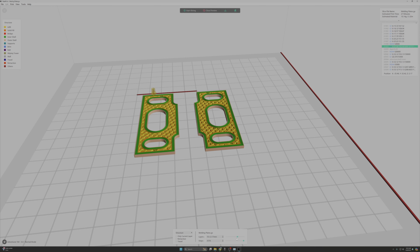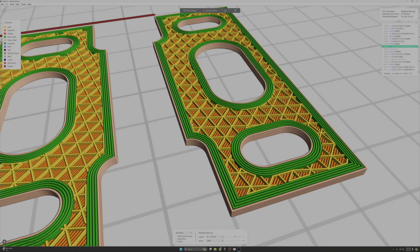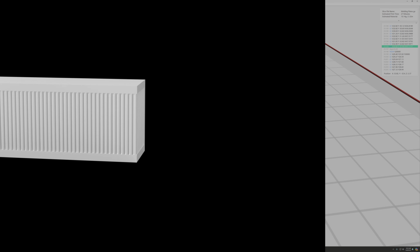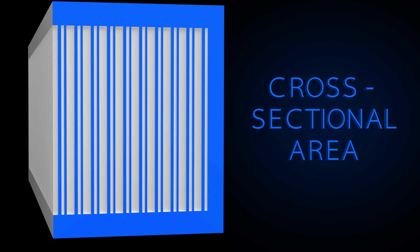This is a big reason why, when 3D printing objects, the infill percentage often has a far lower impact on what people would call overall strength than the number of shell layers. Although, this is definitely not always the case. Shear and tensile strength would definitely change with infill density, as those stresses are largely dependent on cross-sectional area.